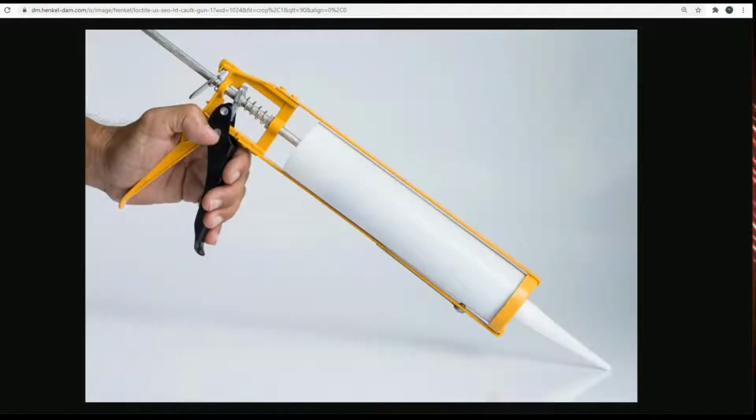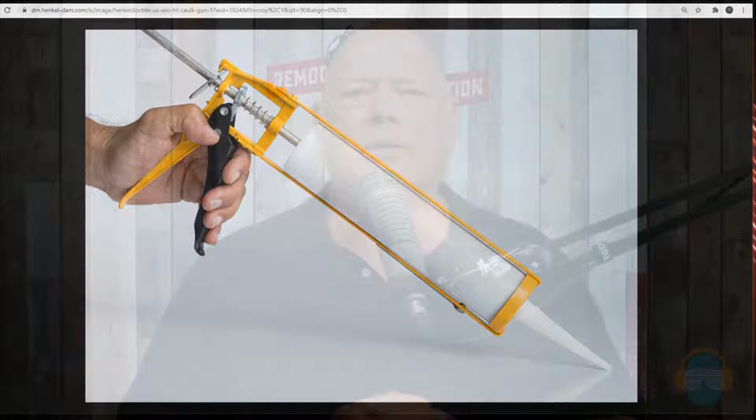And that's the first thing people ask me about, caulking around doors and windows. Caulking is a great and inexpensive way to deal with air infiltration because you're just filling a gap with this liquid that gets hard and prevents air and dust from coming in. One of the things you'll see this time of year is a bunch of dust everywhere. And that, again, is because you're running that air conditioner so much, it's sucking it out of the walls, out of the attic, through little holes around the windows and doors. And so caulking is the first line of defense, I would say.